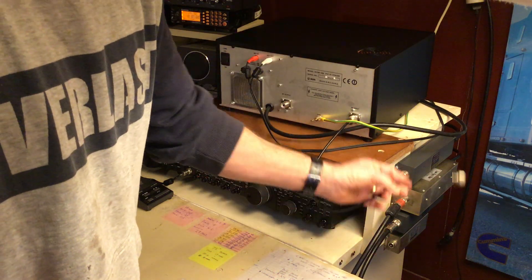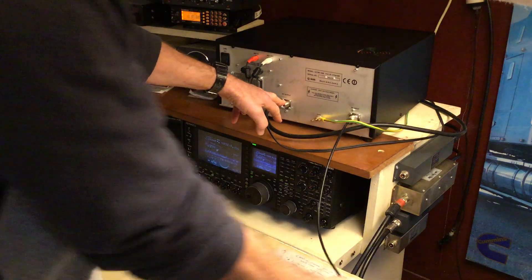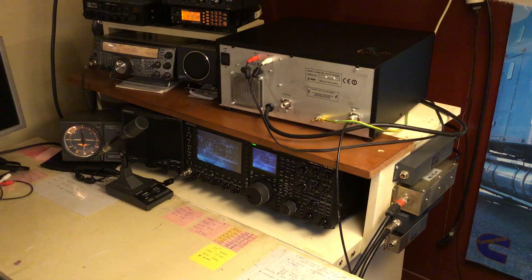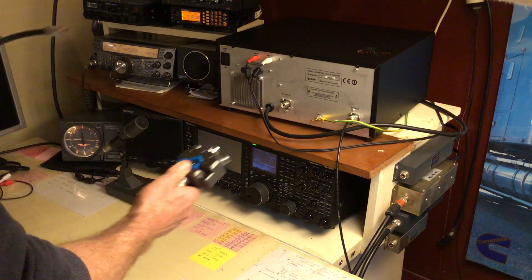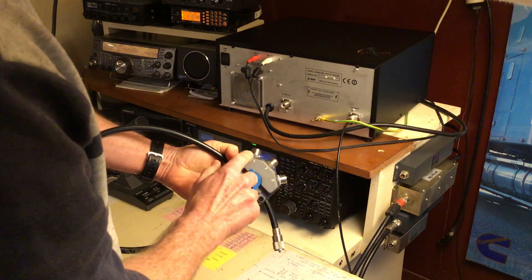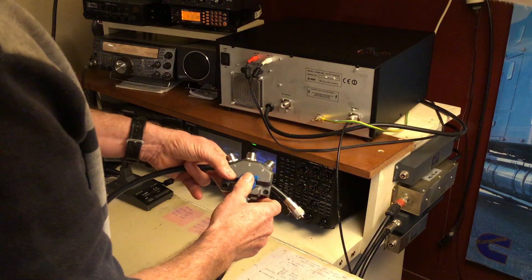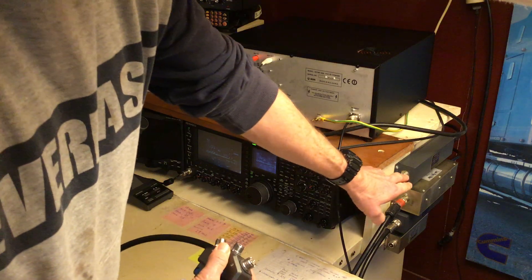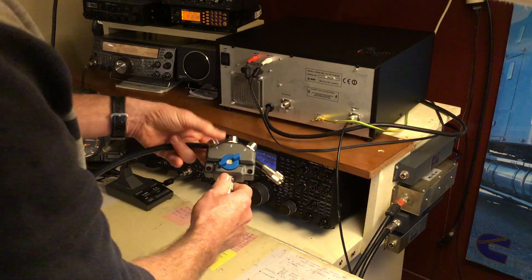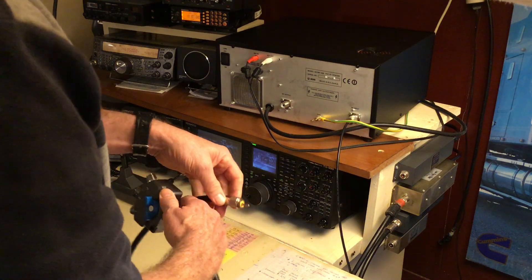I just use RG58 — a little bit of power in and a whole lot of power out. Now they only come with one output antenna port, but if you use multiple antennas like me, just get yourself a coax switch. This one is rated at 1500 watts, and I have 3 antennas. You can get a 4-port or even a 5-port nowadays. I run mine straight out into my low pass filter, which is rated at 1.5 kilowatt as well, because I'm in close proximity to my neighbours — prevention is better than a cure.